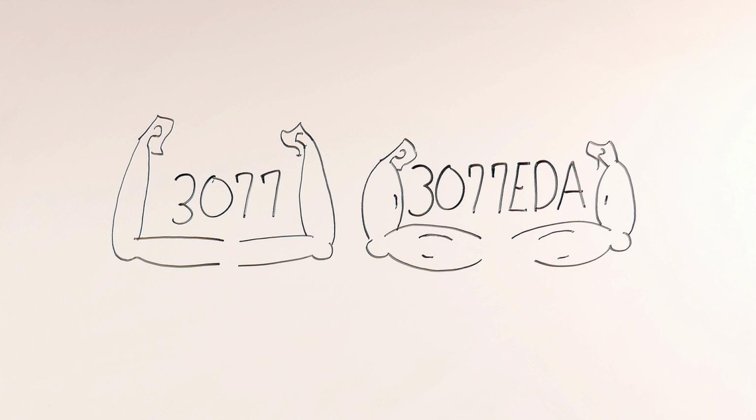The parallel arm in particular is much different for an application-specific closer, which has an extra duty, or EDA arm, versus the universal arm which is attached to a parallel arm bracket with screws. The EDA arm is the standard arm for the LCN 4110 series. Extra duty arms and other optional arms are also available for universal closers, but using a specific arm with a universal closer will mean that the closer can only be mounted in that one configuration.